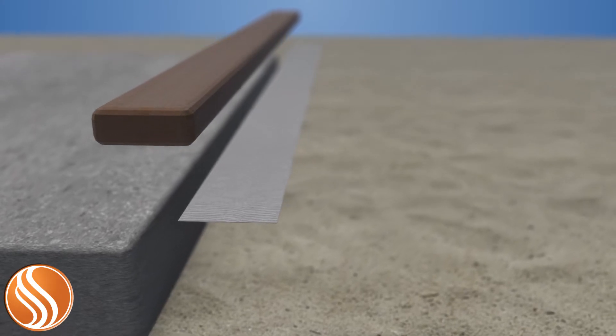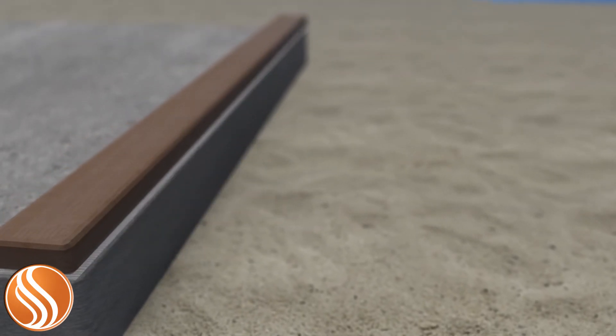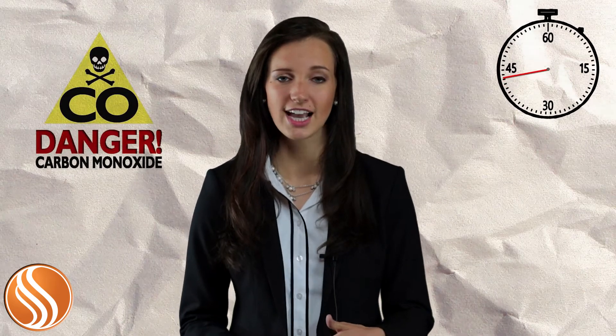This sheet of material serves several purposes extremely well at the same time. It both protects the sill plate from moisture that's emitted by the concrete and seals any gap between the concrete and the sill plate to prevent airflow and energy loss. Preventing airflow under the sill also serves to protect the home's residents from dangerous fumes entering from enclosed garage areas, such as carbon monoxide.